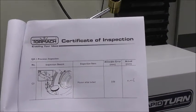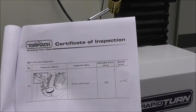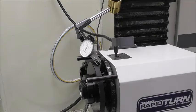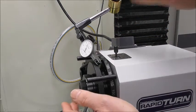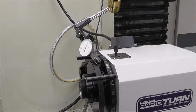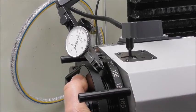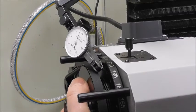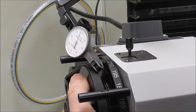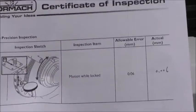Okay, let's measure the rotary motion when locked. The allowable error is six hundredths of a millimeter on the engagement key holes — wow, that's a lot of allowable error. But the actual error they're claiming is six microns, so let's see what we measure. I'll just engage the key by its own spring pressure — I won't try and jam it in because it's probably a taper fit — and we'll put the dial indicator on there. So we'll spring it in one direction and let it go, spring it in the other direction and let it go. I'm getting about five or six microns. You don't really count the spring, just the actual movement after spring. So yeah, five or six microns — which is what they claim.